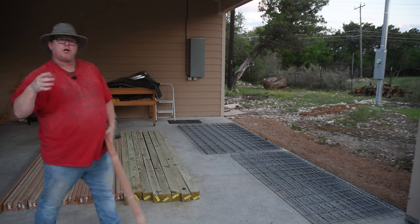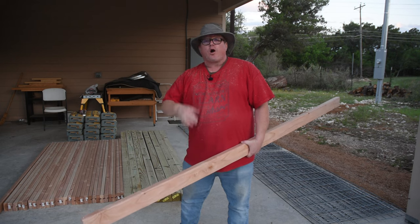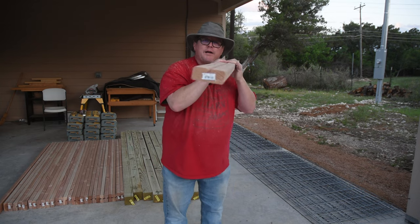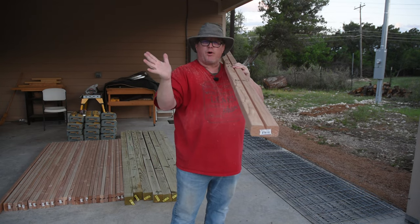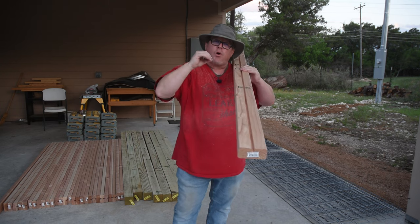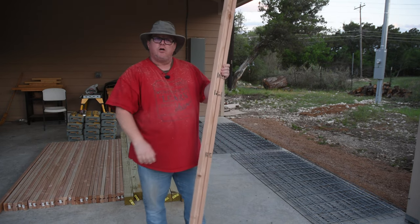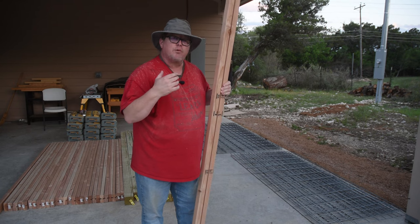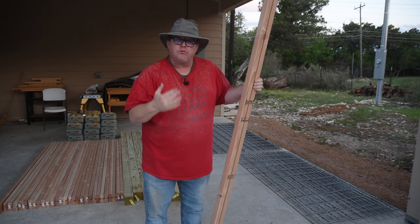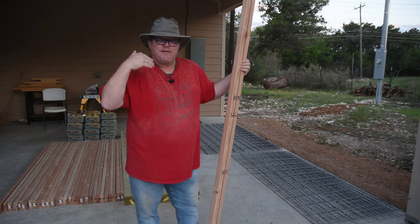But the good thing is, that's the hardest woodworking part. Everything else is pretty much predetermined. Our vertical dimensions are already set. By the way, all of mine I made a 1/2 inch. I didn't do 3/8, I just did them all at a 1/2 inch. 6 of them I have a 1/2 inch from each side, which left a 1/2 inch in the middle. So all those dimensions are set. So are the height of my fences. So I can cut all the vertical pieces now and rest assured that they're going to be okay. The parts that I don't know are the parts in between the poles that I'm putting in, which once again I'm worried about. But I can leave those for later on.